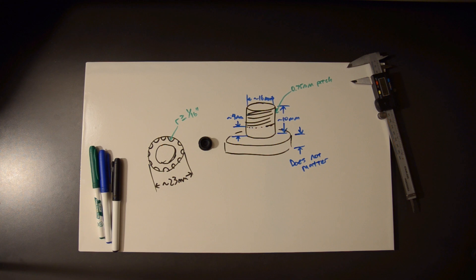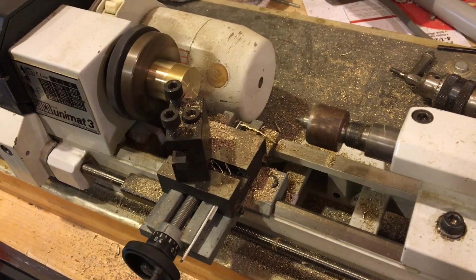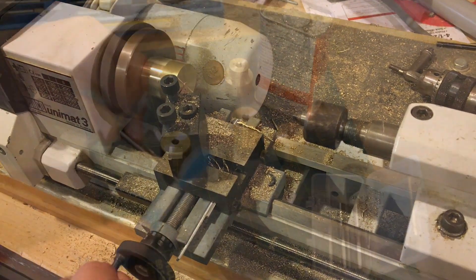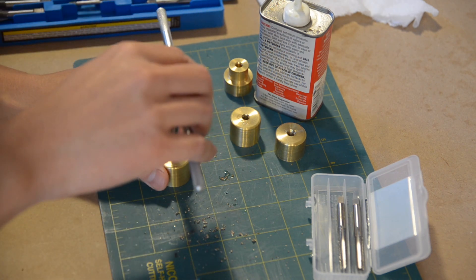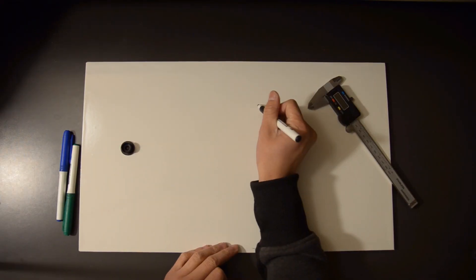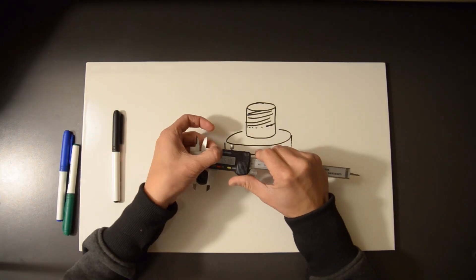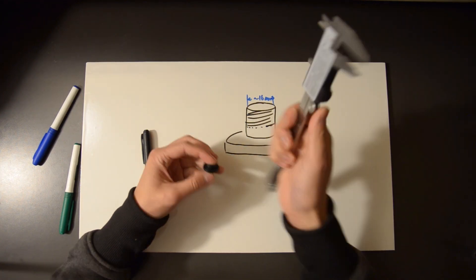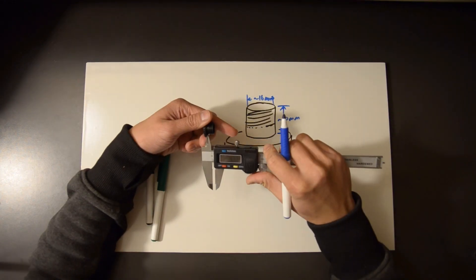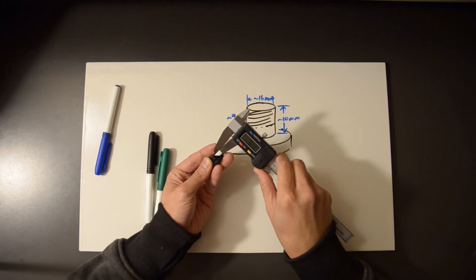In this case, I would machine a cap with an eyebolt that could support the load of my backpack as ballast. The material I would use was brass — I had some conveniently sized chunks originally planned for branding irons, complete with holes sized to be tapped for quarter-twenty. I first started by taking measurements from the original cap, looking at height and diameter. Then I had to determine what kind of threads I needed. The dimensions most closely resembled a 16mm diameter profile with a 0.75mm thread pitch.